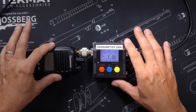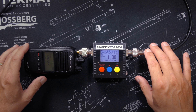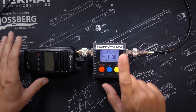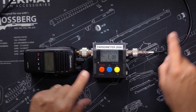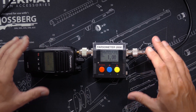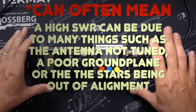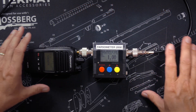467.675 hubba-jubba-hertz. You really do need an SWR meter if you have a mobile or base station radio so that you can test your entire antenna system — not just the antenna, but the cable, the antenna itself, the ground plane, and the mount. Because a high SWR, like 3-to-1 or 4-to-1, usually means a bad ground plane or a problem with the cable, not necessarily the antenna.